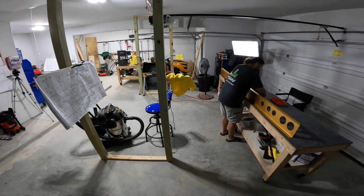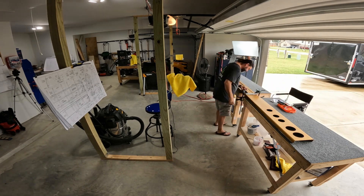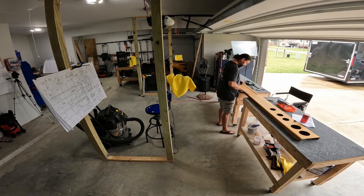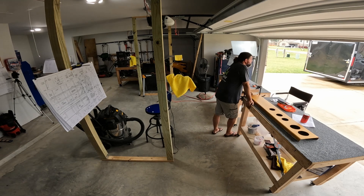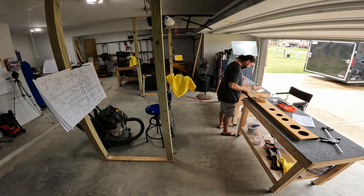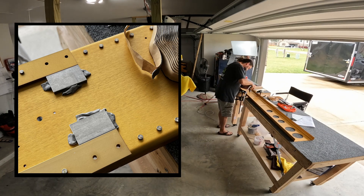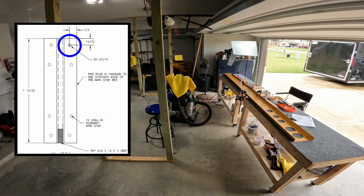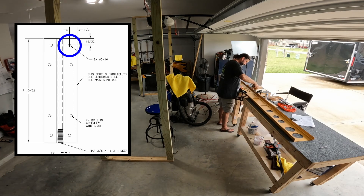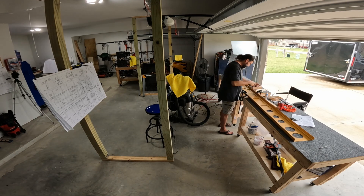Getting it all fitted was tricky. I tried several ways to clamp it down, because when the spacers are under the extrusion there's no tension, and every time you flip the spar over — which you have to do to back-drill using the spar as a guide — those spacers just slide. What I ended up doing was using a little butyl to gum those spacers in place so I could flip it over and back-drill. The process: drill one hole to locate the extrusion on the spar, cleco that hole, get the rest aligned, clamp down, flip over, and use the spar as a drill guide for the remaining holes.